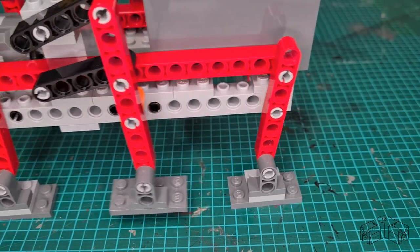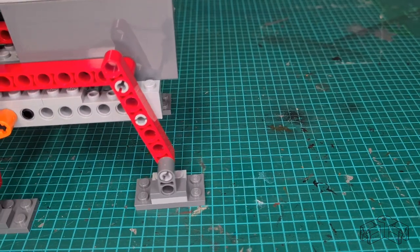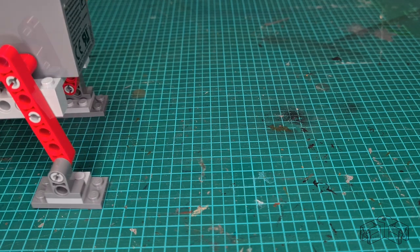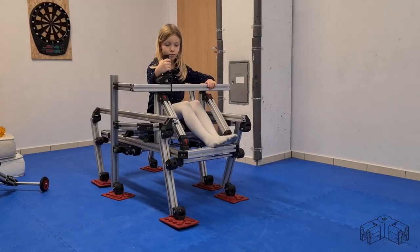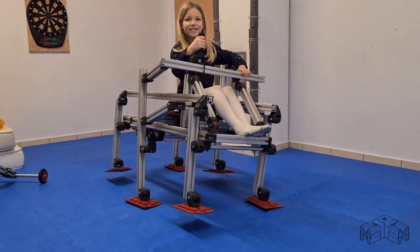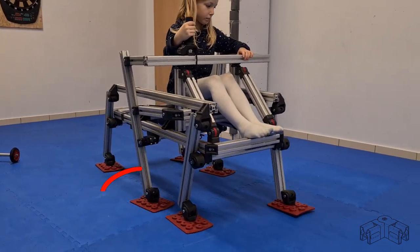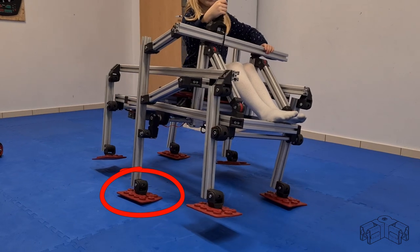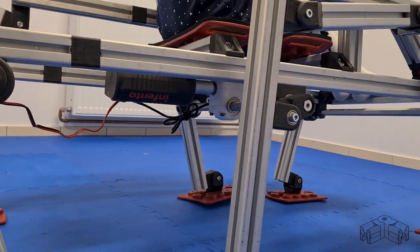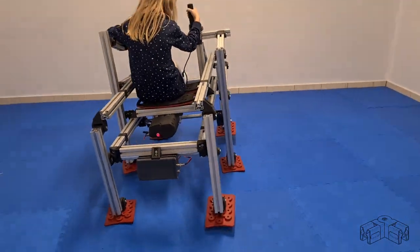When I finished my first build that copied exactly the dimensions of the LEGO Walker, I noticed the step length of the center legs was not identical to the step length of the front and rear legs. The walker yawed around the vertical axis at each step. The bearings and the motor had a hard time from all the friction when the feet were forced to smear over the ground, especially with my 7-year-old daughter sitting on the AT-TE. The friction was too high, so I had to make some greater adjustments to almost every profile until I got it working properly.